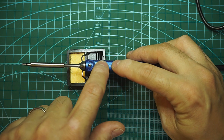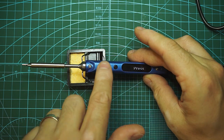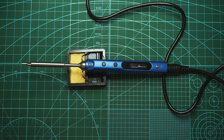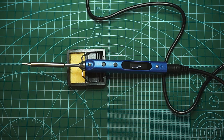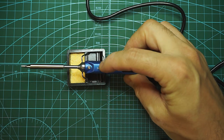I'll power it off now. Pressing both buttons at the same time puts the soldering iron to standby mode. I'll wait for it to cool down, then change my power supply to 24V — the maximum they say it can handle. It started up. Now let's see how fast it goes up to 300°C.